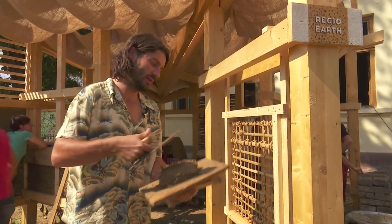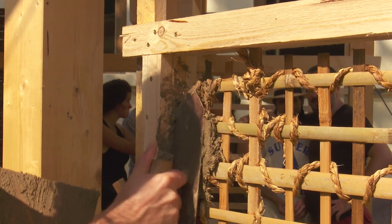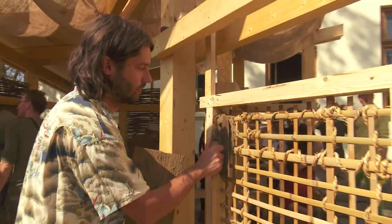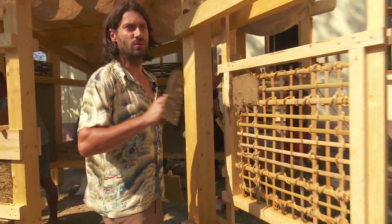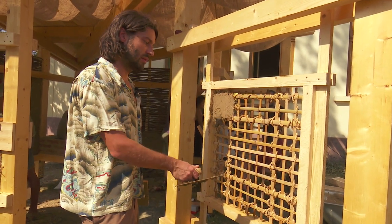This is how you make a ball and then you spread. It's got a bit hard. As you can see, because Japanese houses have a wooden framework, it only connects at few points. This is again because the wall needs to be kind of elastic to resist the shakes. So there are only a few points. And the bamboo net is tied with rice straw.